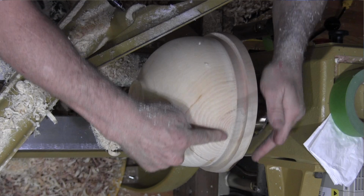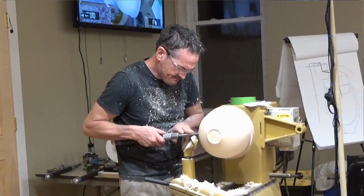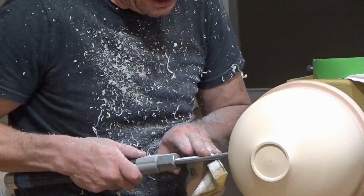That's why I'm able to go directly into end grain with a 40-degree sharp edge and a massive burr, and it doesn't grab and I don't lose control. Almost there, tiny mark. I've still got to leave the gouge mark, you see? I just want to get rid of that. I don't know if I've still got the burr. The burr doesn't last very long, but it's still got enough. I just don't want to be aggressive with it.